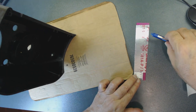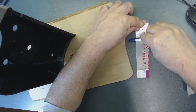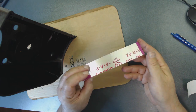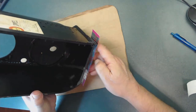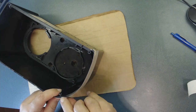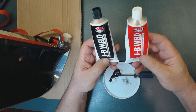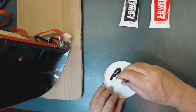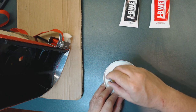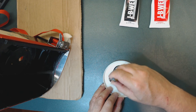The goal is that the epoxy doesn't stick well with the aluminum foil, so I can remove it much easier. I'm taking all the bubbles out so it's totally smooth. Now we want to put this here. These are the products I'm going to use: JB Weld as the epoxy. Add them together and mix them really well, then fill up that area with it. We have to make sure it is mixed really well, otherwise it's going to be sticky and not going to cure well.